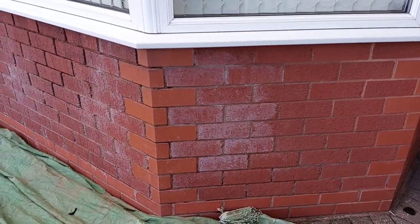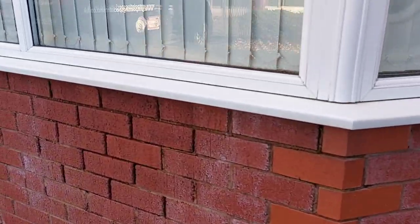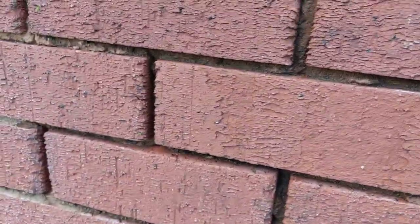Little job for me — problem with the efflorescence, and it's actually windswept, deteriorated. Could be either the wind, or it was just a bad mix and they've pointed it in the full sun.